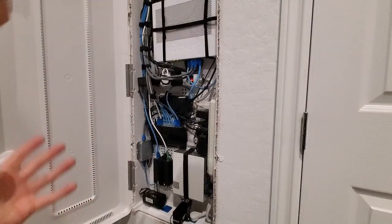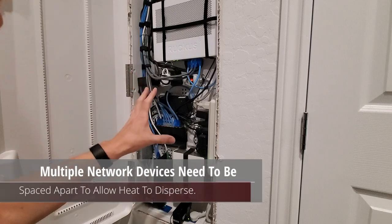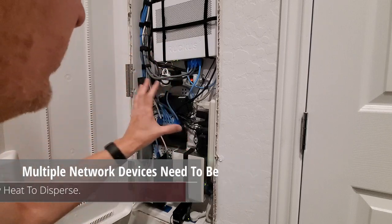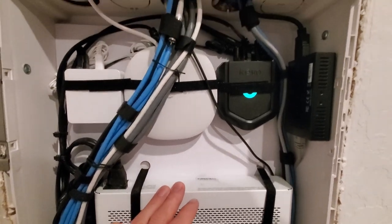You're probably saying, hey, why didn't you install it down here? The main reason is we didn't have enough room. The way I wanted to set this up is to have a little break in between the hot devices — you don't want all of them crowded together too much. The location here is good because above the switch there's at least 12 inches of space for that heat to radiate out.